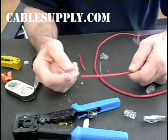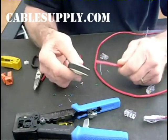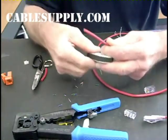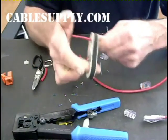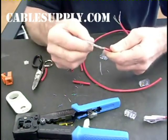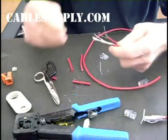What we want to do is put the strain relief on first, because then we're going to remove the jacket and once you spread the wires apart it's hard to get on. Let's open up the stripper — this cable here is a little undersized so I like to use this model on it. I'm going to just score the cable; it's still intact and then you just bend it and it pops. This way you know you didn't nick any of the conductors.